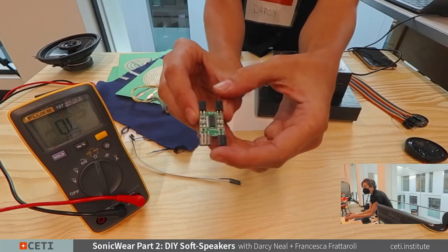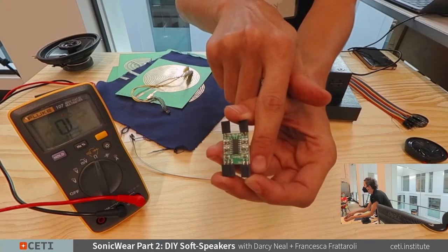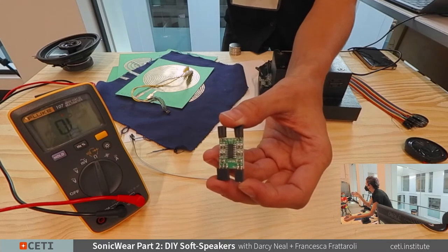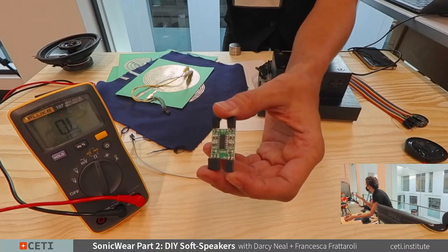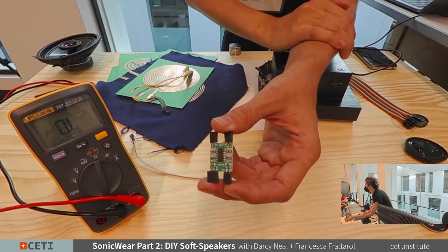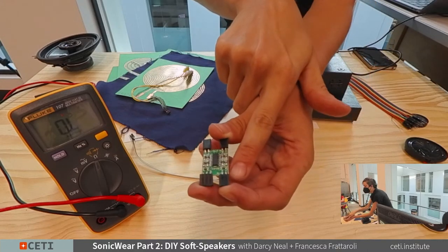On these, like we saw in the diagram earlier, I'll just point it out on here. This has the voltage input. It says 5 volts on here, but I think you can do anything from 3.3 volts. I wouldn't go up to 9 volts, just stick with the USB voltage range, which is 5 volts coming out of USB. And out of your battery packs it's like 4.5 volts, I believe, which is perfect for the 3 AA or 3 AAA battery packs that you have in your kits. So that is going to be the input for it.